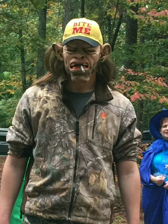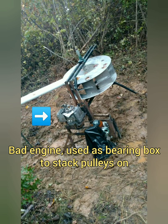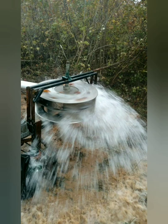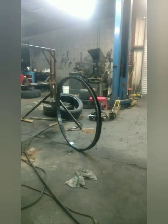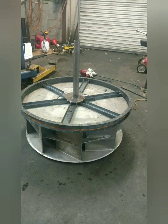I've been doing water wheels and trying to make electricity for longer than I've been doing YouTube. This is the first one I did, which runs on a pulley — it was a little small pulley. It didn't spin the generator fast enough, so I decided I needed to make a great big old pulley. The aluminum thing I'm using as the water wheel I got from a scrapyard, and I took a piece of C-channel, cut it up, and made a big old pulley to get better gear reduction.